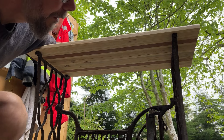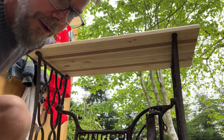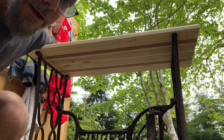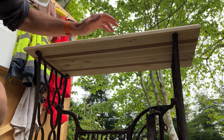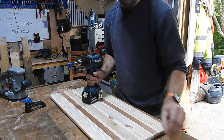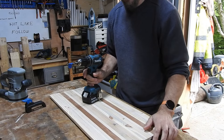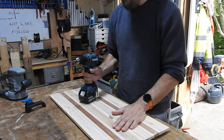So what I've done — I've centred it, got it in the position that I wanted, and I've marked now where I need to drill so I can take this off, get it drilled and get the threaded inserts put in. I've got my drill bit, I have my threaded inserts, and I also have my stainless bolts that I'm going to use. I've marked off on the drill bit for the depth that I need to go down to.